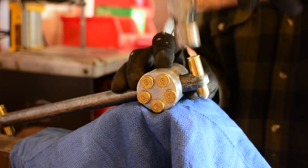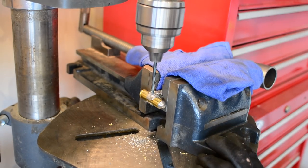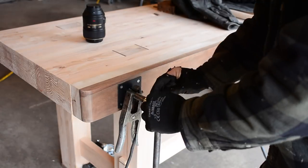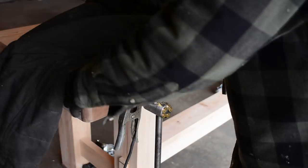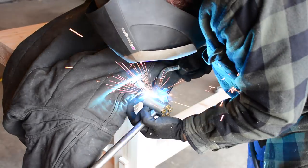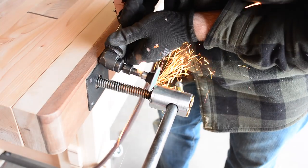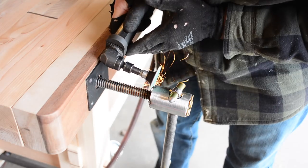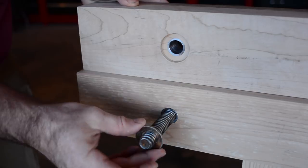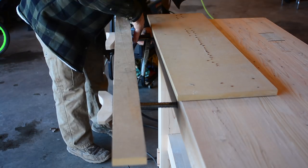Remember, this is an empty casing that has already been fired with a piece of steel inserted back in to represent a bullet. This probably isn't the safest thing to do and I would not recommend trying it at home. The handle is welded in place and then ground smooth to a pleasant finish. The washer will be tack welded to the acme rod to allow the face of the vise to track with the mechanism of the vise.